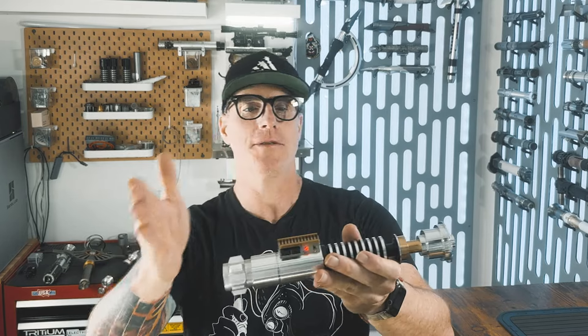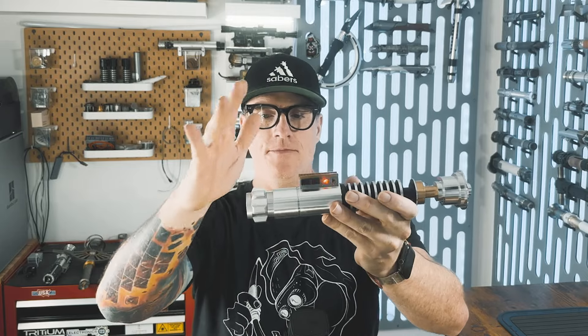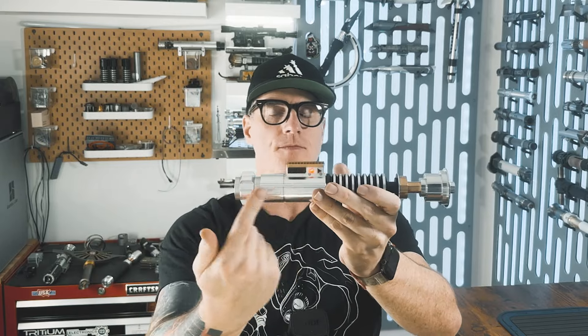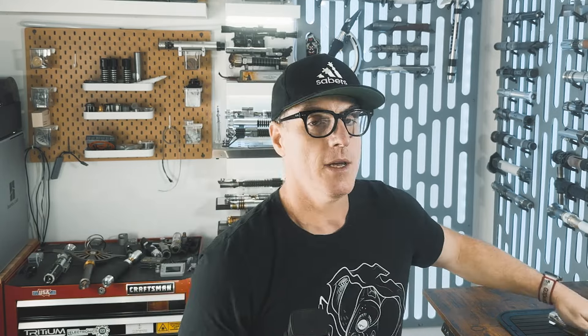Doing Luke's hilt and Obi-Wan's version of this hilt — when you've got a control box that is this low, it presents a few challenges. You've got switches that are low that you've got to wire up, you've got LEDs and arrows here that are low that you have to wire up. That presents some challenges because you've got two options: either a static internal chassis where you can wire those things up, or a removable chassis with a pin system or something like that.